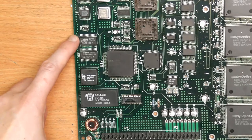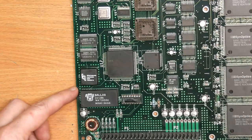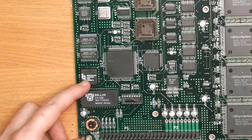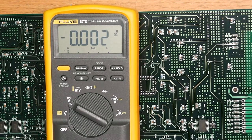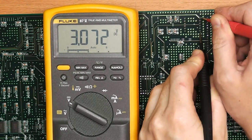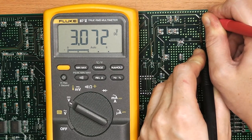And those two here happen to be SRAM chips, and actually you can even see a trace going over here. So I'm suspecting they are storing some part of the configuration in SRAM, actually, which is kind of odd. You don't see that a lot. So this is the back side, and this here is the outline of the BQ2502. And I just want to see if after over 10 years in the basement it still had any juice left. So I looked into the datasheet and found out what the pins were, and sure enough, it supplies a steady 3.07 volts.